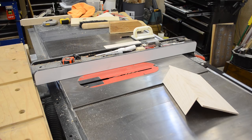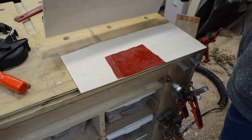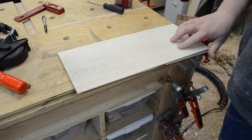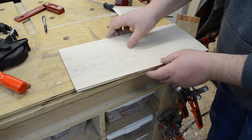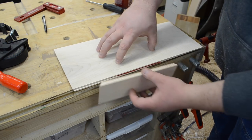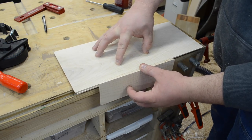For the top, since it's going to be a unique two-piece design, I had to size the dado a little differently. I had a piece of scrap red velvet that's actually going to be laminated between the two pieces of the top. So when testing the fit I had to make sure that velvet was in there to account for that thickness.